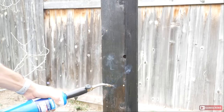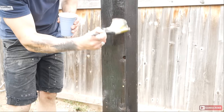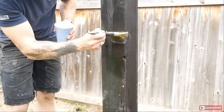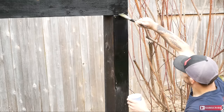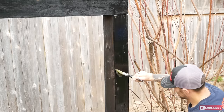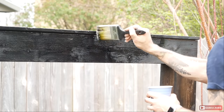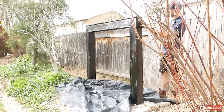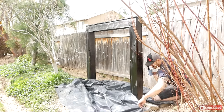Once it's burned to the finish that you want, you can clean it up using a brush. Once it's clean, we're gonna seal this project using boiled linseed oil, applying it with a paintbrush and applying three to four coats or until the project stops soaking in all the oil. Once you're happy with the finish, go ahead and wipe off any of the excess and you'll be ready to install the plumbing parts.